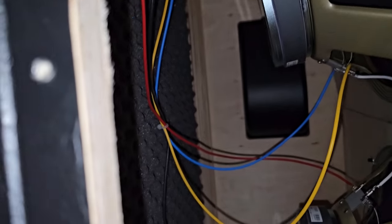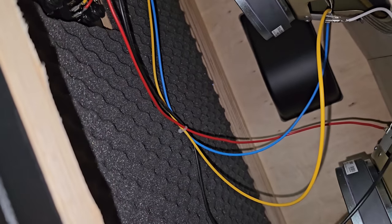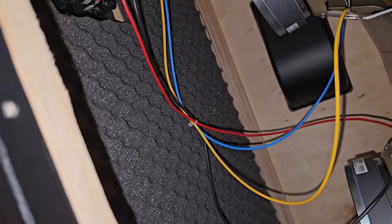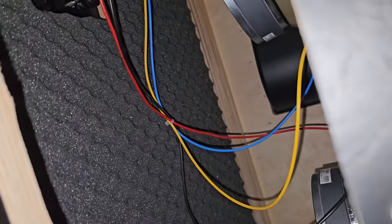Then, interesting, on the back panel, and I believe my other Angle cabs were like this too, we've got this foam batting here. What that is going to do is soak up some of those high frequencies, so it's not going to be so bright. Instead of reflecting directly off the back panel and bouncing back outwards, this is going to soak up some frequencies. It is going to alter the sound. It is going to subdue that top end a little bit.